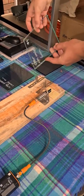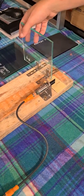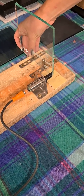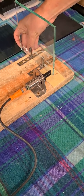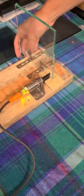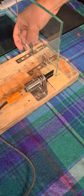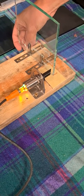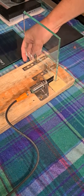We find a straight edge, set it up on the test rig, and the red mark is where we found it switching previously. So we bring that clear glass in — we're looking for an orange light on the back of the sensor to indicate the output is switched. Now just moving it between output on and off, you can see there's barely any movement of the glass to get the output to switch — about the width of a pen.